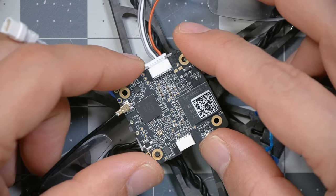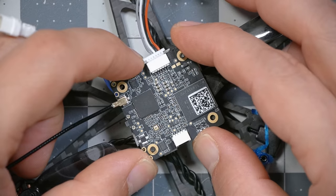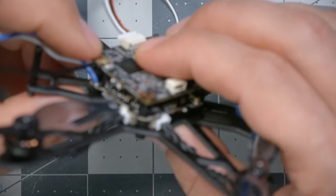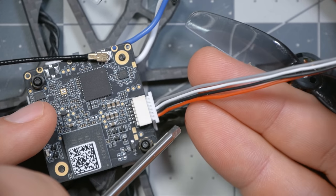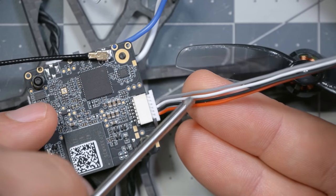The video transmitter has M2-sized mounting holes with no room for spacers — they'll drop straight down, and I'm hoping the existing hardware on this BetaFPV quad will work without finagling. The plug comes with four wires: red for power (3.1 to 5 volts only), black for ground, and white and gray for the UART TX and RX connection. The UART connection is not truly optional — you really want it because it gives you the full BetaFlight OSD in your goggles, which is super useful.